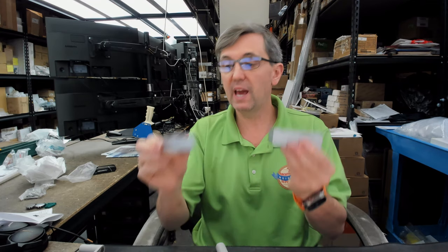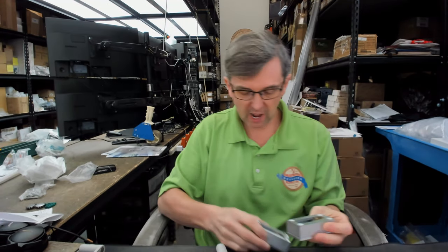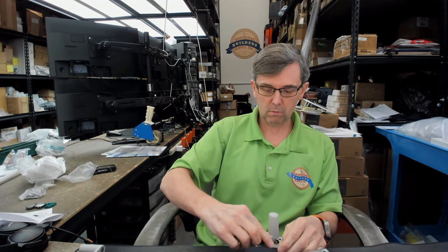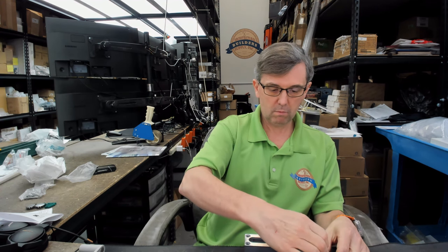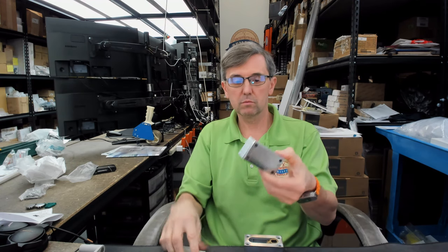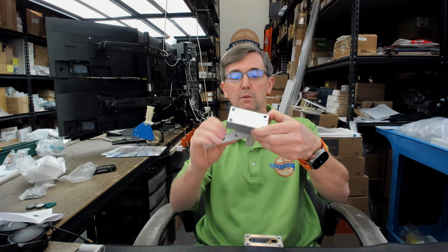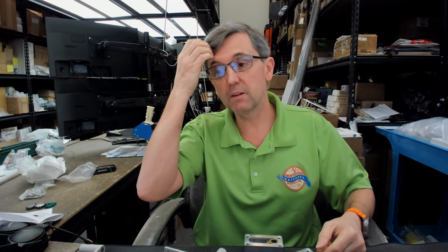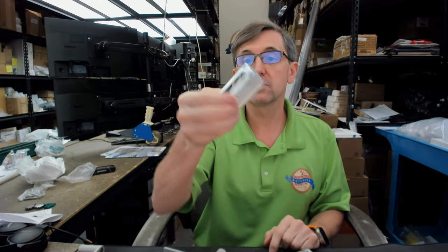You're going to have your rack cases. As far as I can tell, you're going to need to install those in the proper orientation depending on the door swing. The door is not double acting with these, it's just center hung, and that's kind of odd because center hung are generally double acting unless you prevent them from being double acting. This is center hung and can never double act because of the rack sort of concept.